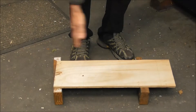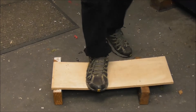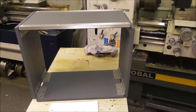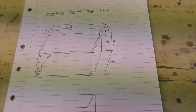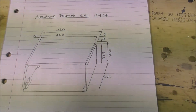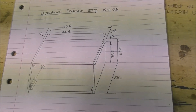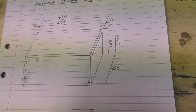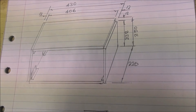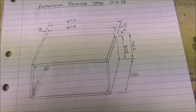Remember to have the plywood grain running lengthways, because that's the outer surface in tension — it'll be very much weaker if it runs crossways. Now it's all ready to bolt in once the glue has fully set. Looking at the dimensions if you want to build one yourself: this is a single-step design, though it could also be built as a double step. The dimensions I chose are 430mm wide, 350mm high, and 220mm deep.